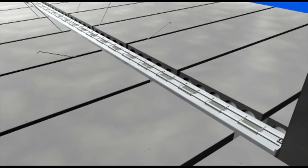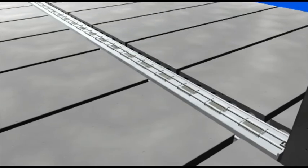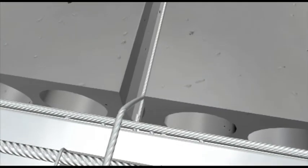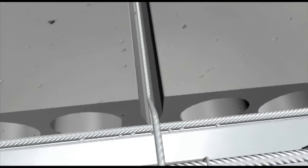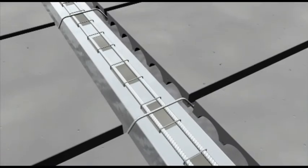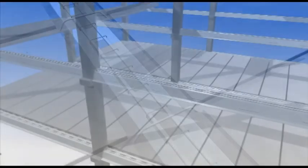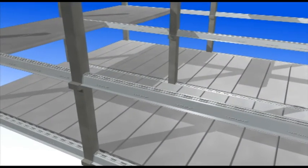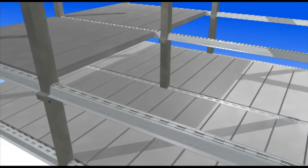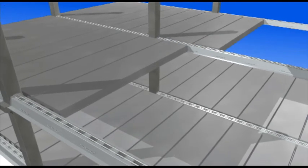The deck joint reinforcement can easily be placed. No holes are needed. When the reinforcement is in place, all joints will be cast. The floor deck should not be loaded before casting. In the final structure, the A-beam will act together with the deck elements and surface grout. The A-beam has been designed for use with 200 to 500 mm high hollow core deck slabs.